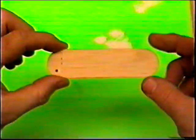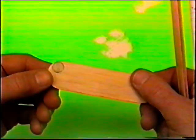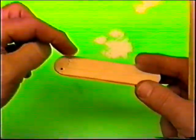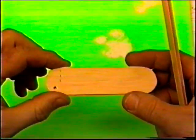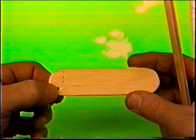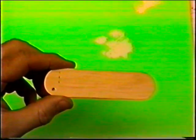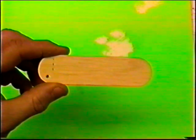Now it's just a question of using that hole, and it should line this piece up perfectly. And see, that's part of any engineering little project or exercise that you do, is always having one piece line up the other piece. Same thing with the cowling hole bands, landing gear blocks. There's just a million little things that if you have the sequence down, the rest of it just follows right in order. Save yourself an awful lot of time.